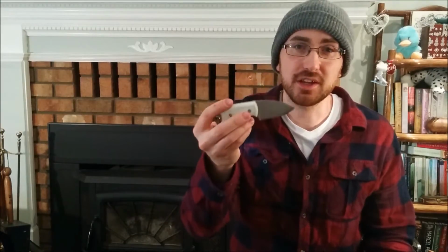So here's my knife. It's the EDC knife that those of you who have seen my other video, I showed how I shaped the metal and everything, but I have now completed the knife 100%. And this is my first official knife that's totally completed. I put white G10 handles on it. They're quite thick and it gives it a nice, good grip on this shorter blade. So it is a little bit heavier, a small knife roughly 5 inches long with a 2 inch blade. And I went for an exposed pommel end here for the lanyard hole.